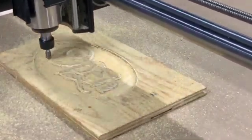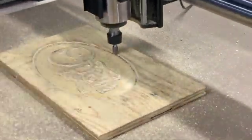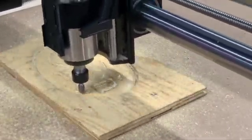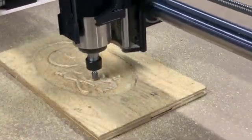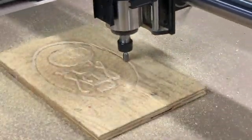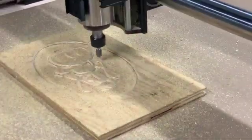Just in a piece of plywood, I used a method of taping it down. I put painters tape on the table and then painters tape on the back of the plywood, and super glue in between. It seemed to work very well.